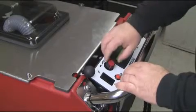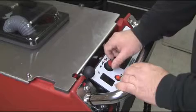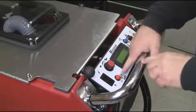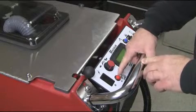Next, check the operation panels from the operator's left to the right side, as shown. First, check the reverse and the forward speed control to confirm that the correct machine direction and speed control are within the manufacturer's specifications.